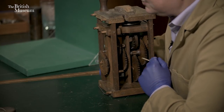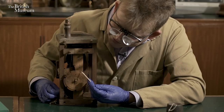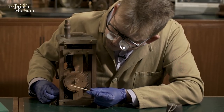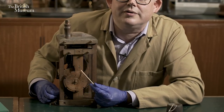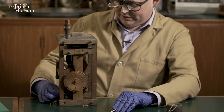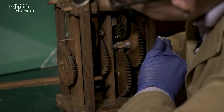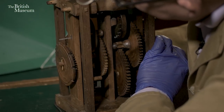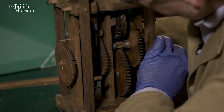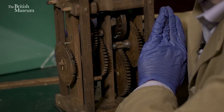Now looking on the back of the clock — obviously somehow the clock has got to know how many strikes to strike at each hour: three strikes at three o'clock, four strikes at four o'clock, and so forth. To do this, it uses this device here which we call the count wheel. What you'll notice is it's got little slots around the edges that, as we go around, the spacing increases — and that's the basis on which it counts. If I set the clock off again and lift the lever, you'll now see this pin coming up, and every time you see that lifting, you'll hear a dong on the bell if the bell was on this clock, but it isn't. So you see the little pin there feeling for the hole, but if it doesn't get it, it lifts up again until it finds the slot, and then the striking stops — and that's how the striking system works.